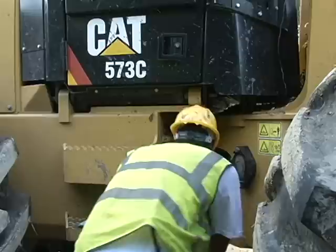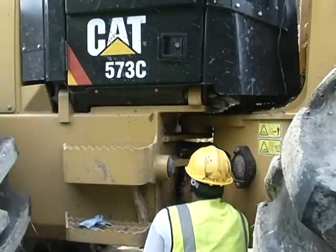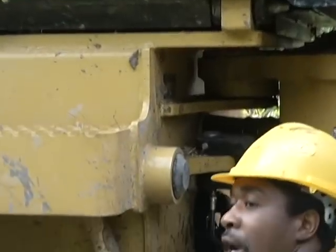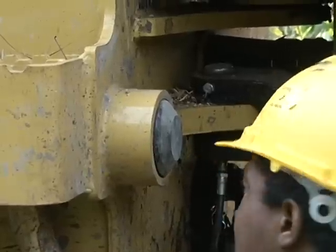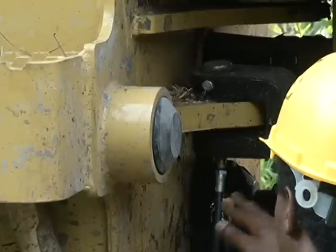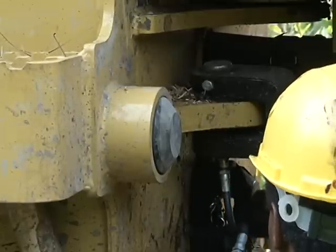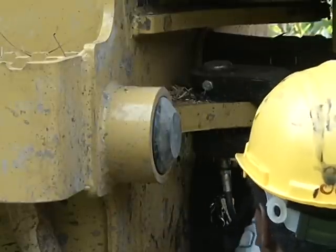Right here in the center we got a few fittings. We got a fitting up under here for the steering. Usually if you do it every day, it should only take about five pumps. You just want to do it until you're able to see grease — depending on the fitting is where you'll see grease. You get five good strokes and pretty much once you get it, you'll be in there.